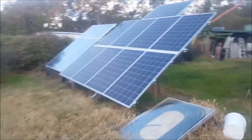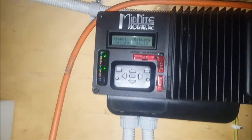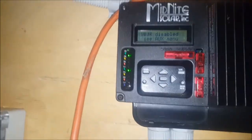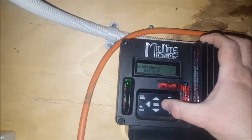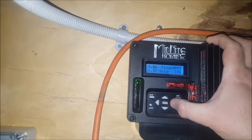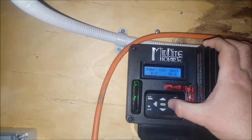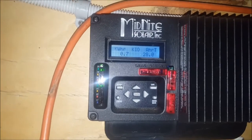I'll talk about the bees tomorrow. Right now I'm just gonna have a quick chat about the solar — as you can see, completely shaded out. As my subscribers know, this is my weekender — one day it'll be my forever home. During the week I'm not here. The charge controller is on float. We're at about 26.3 volts. I'm only getting 0.7 kilowatt hours, 28 amp hours coming in off that two kilowatt array.